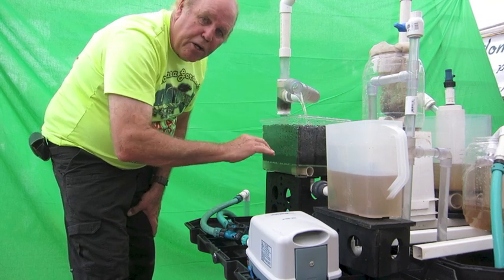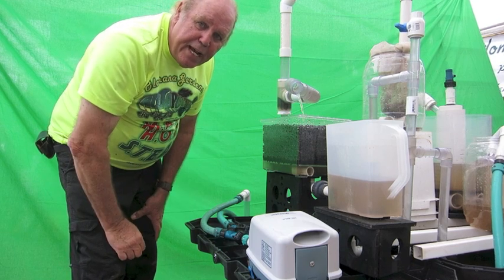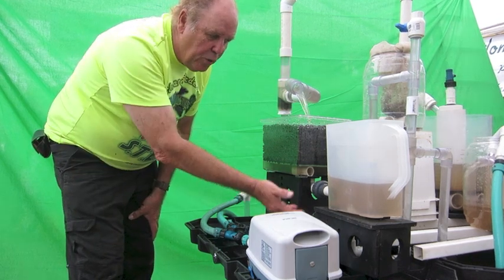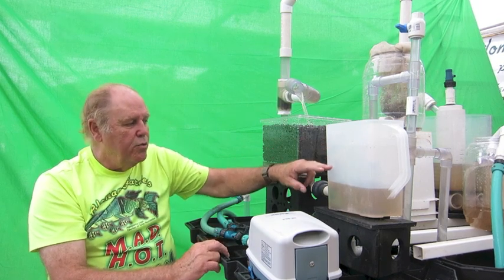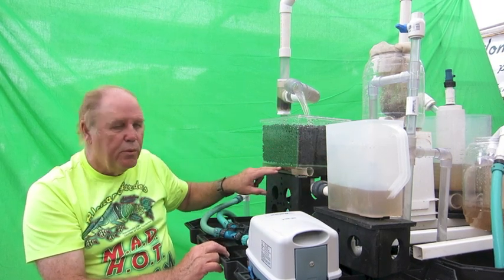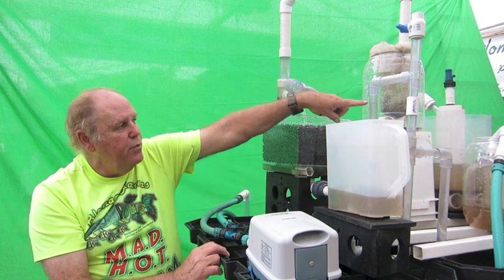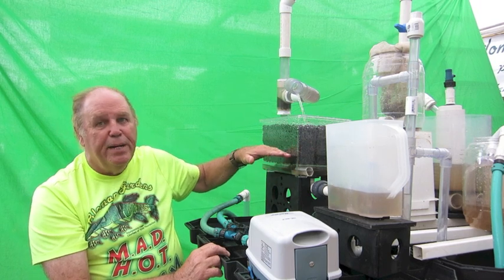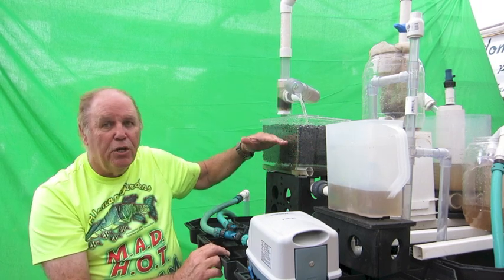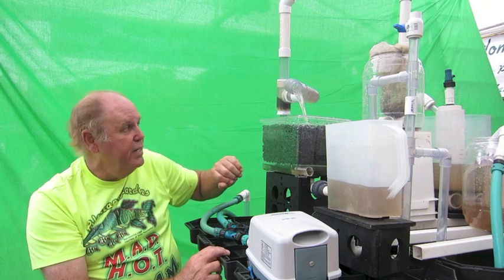When it gets down to the bottom, there's a clear pipe on the other side, and you'll see the water gets down. It will break, and then it will set the level, and then the whole thing will fill up. So the high tide mark was here. We're going to drain all the way down to here — notice we're below the level — then we're going to get an air brake, and you'll know that when you see the water up here drop. Now this will fill back up. When it fills up, it pushes all the air out. When it goes down, it pulls the air in — so it's like a living lung.